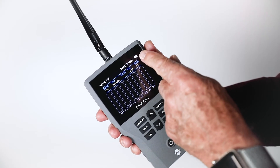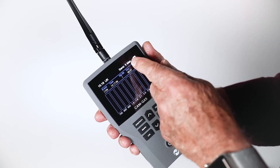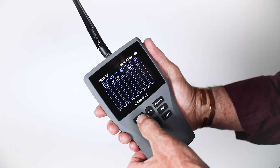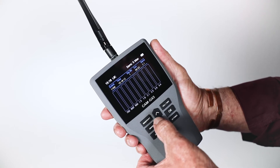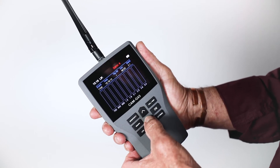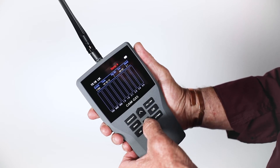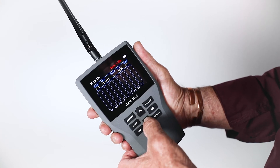Now view the top right of the screen. The condition of the battery is clearly visible, and to the left there is the sensitivity setting. Pressing the sensitivity button will change this part of the display to red, then the up and down keys can be used to change the sensitivity for use when hunting down a signal source.